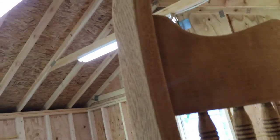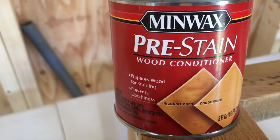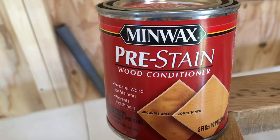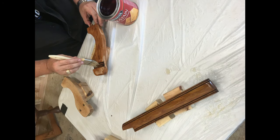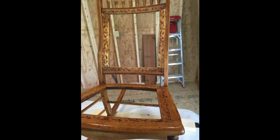As you can see, the wood is pretty dry from the sanding and the age, so one of the things we wanted to do was put some pre-stain wood conditioner on. In these next photos you can see my husband putting on the conditioner — it changes the wood quite a bit. That wood soaked it in pretty good. We had to put that all over the rocking chair.